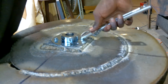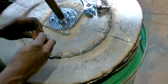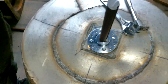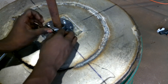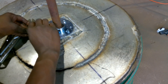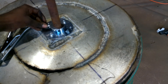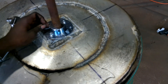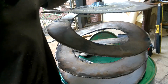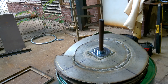I put the shaft in and the key in as well. Then I tighten down the casing — whatever you call those Allen set screws that mount into the shaft, I screw those down. Once tightened, I want to give it a little test because this thing really needs to grip — it's going to be under a lot of force and pressure. I went to lift it up — at least 30 pounds or so — and it held on pretty good. That was a pretty good sign.